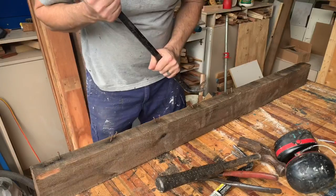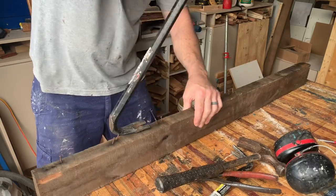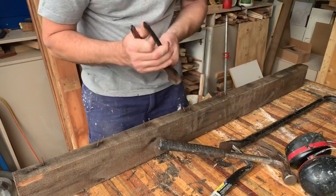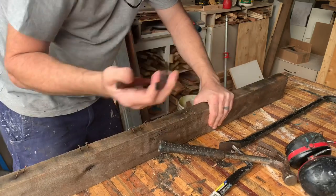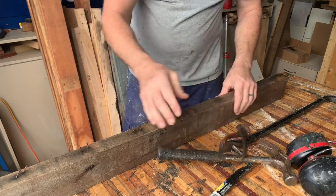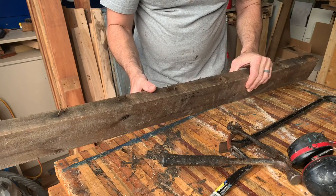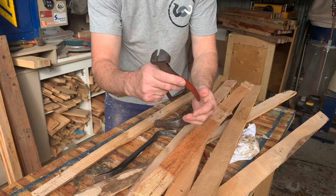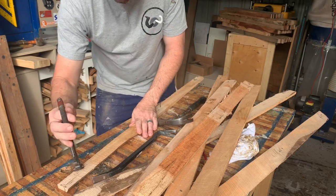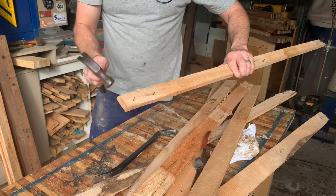Here's another tip. The head of the nail can just break off because it's so rusted. If you really want this piece of wood you've got to get these nails out — these pliers can help you just to pinch it and pull the nail out that way. You'll also notice that this timber has been left out in the rain and is quite wet — that's another way to get your nails out, then you can set it aside to dry. Quick tip: get yourself a pair of pliers for these very crappy little nails. I know they're going to bend over and be a pain to pull out, so I merely just clip them off — that makes them far quicker to tap out and get them out in one go.